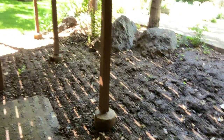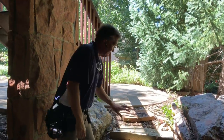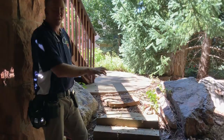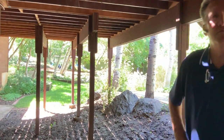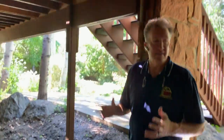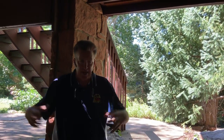This whole grading area back here — take a look at all the drip lines in the dirt. Notice everything from the edge of the deck slopes downhill to this point. Where does all this water go? It collects and ponds right here. This classic rot of stairs — these were treated railroad ties. It has a shell of a shape but it's all deteriorated from the underside. That's the way the railroad ties deteriorate. What they should do is get the vinyl pieces that hang down underneath, put on each of the joists, and carry the water away to a gutter. Somehow you're going to have to get in here — if a hole was cut and an underground pipe was run off to daylight down there, sump it out or just let it flow out.